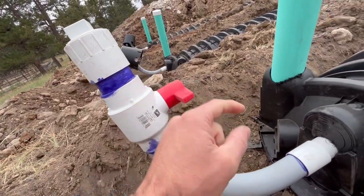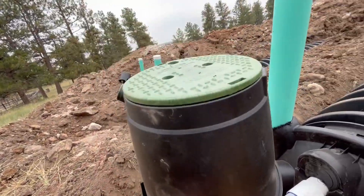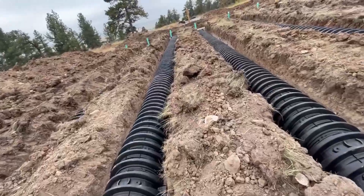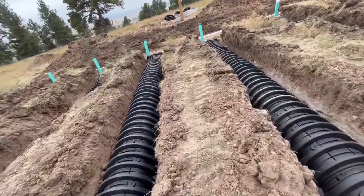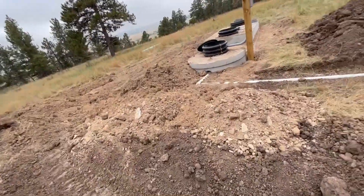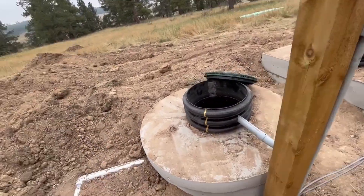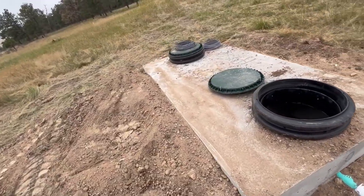This is the valve that would turn on and off — it's just on the other side. This system is more complex than I'm used to. To summarize: the leach field septic system has all the liquids come through here and leach into the ground like a strainer after anaerobic digestion. I'll see if I can do a video on anaerobic digestion — basically you can use the gas from your waste, methane, all the things cows fart out, greenhouse gases — capture it and use it just like propane to cook with, turn on the stove, whatever you want. High hopes, my friends — that's what to do with your crap.